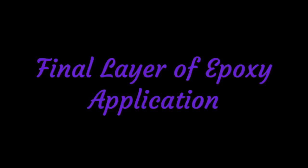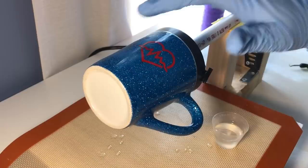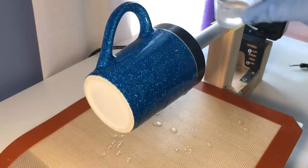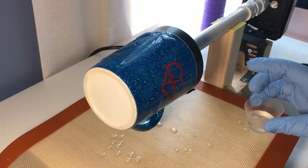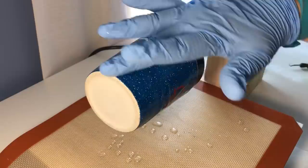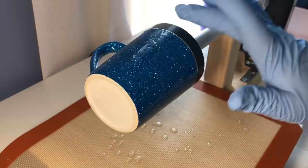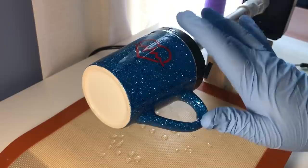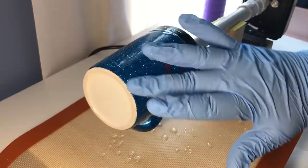This is the final layer of epoxy. Before applying the final layer I usually let it set up just a little bit, watching it to make sure it's getting slightly thicker than the first layer. That way when it goes over my decal it'll be a thick enough layer that I don't have to worry about the decal poking through or ridges around the decal. Apply it just like you did for the first coat — hit the edges where the tape is, the edge on the bottom, seal in the bottom, and pour enough over the handle to get it completely covered.